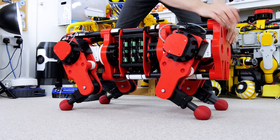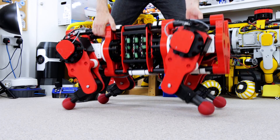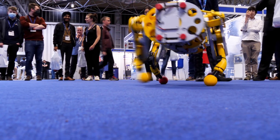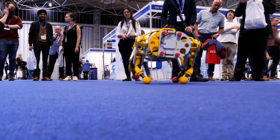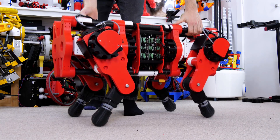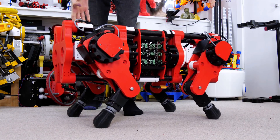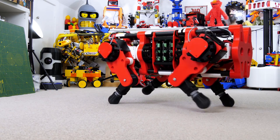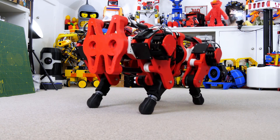You may remember that when I first powered the robot up it was quite springy. This is just because the joints are back-drivable and the oDrive motor drivers are trying to hold the motor position. This is one of the main reasons that Open Dog version 2 and version 3 work at all, and we need to get those motor parameters just right. I've turned up the oDrive position gain value slightly differently for each of the knee, shoulder and hip joints so that the legs absorb impact as best they can like a virtual damped spring. Along with getting the gait timing just right, this results in a fairly dynamic robot under most conditions.